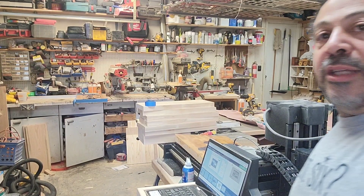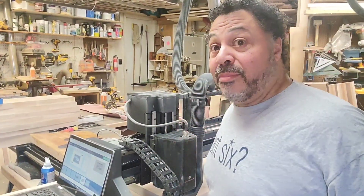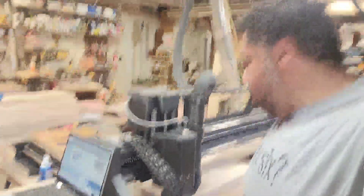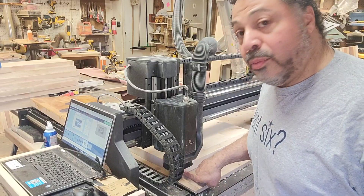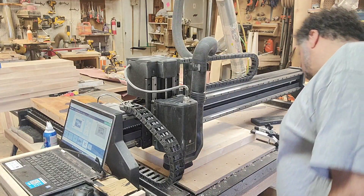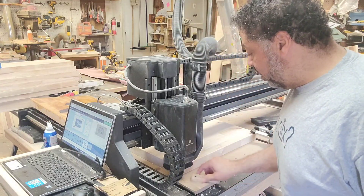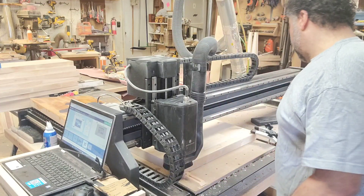We are learning as we go. Make sure you've got it clamped down good. What I'm going to do differently when I redo this one is put small clamps here to make sure it can't move side to side, and put clamps this way too so it can't move either way. That'll hold it square — that's another thing I learned.